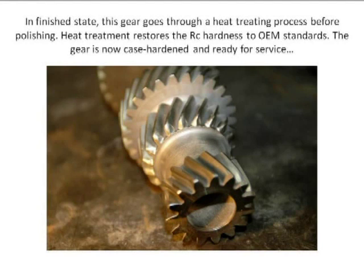And this is after heat-treating. This gear can go back into service — it will function as new. It's been heat-treated, so the entire gear is now case-hardened again, at a Rockwell hardness of probably 58 to 62, with 32-plus thousandths depth, and back to something close to spec. You're ready to go.